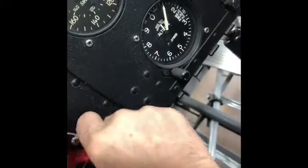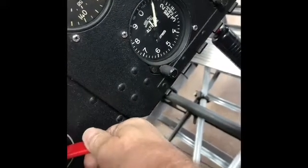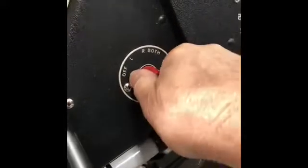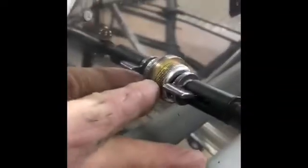The reason why is the mag switch has a little bit of play in it, so it'll take that out. Hopefully, I'll give that a go as soon as I get this other panel out. This one's tight. So left, right, and both, you can feel the switch. Took some slack out here and let this engage more. Those are washers or spacers. Could have made something pretty, but I just drilled out some washers, so that's good. Yeah, that's about it. Finished taking the sheet metal off.